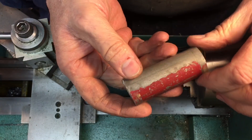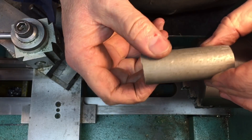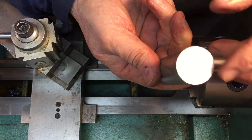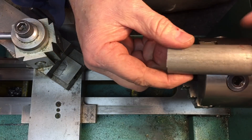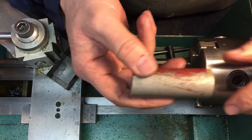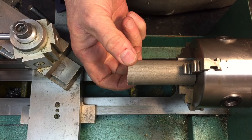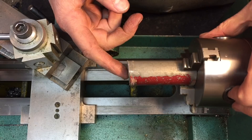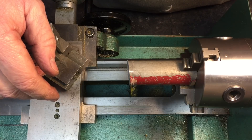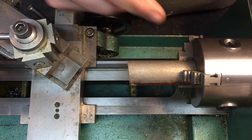Here we are at the lathe. We cut off a small chunk of aluminum — just about the right size — but we need to clean up the ends. One nice thing about a larger lathe is you can pass a one-inch piece of aluminum through the chuck without cutting a piece off, wasting less. With a smaller lathe you can't fit it through, so we're chucking it in to clean off both ends. There's a large overhang, so we have to take very small amounts off the end. We'll clean this side up, flip it over, and clean up the other side.